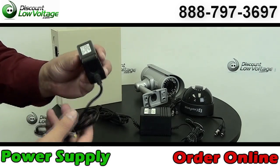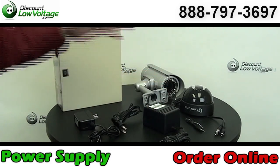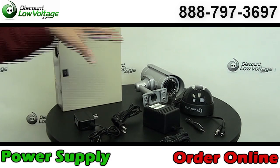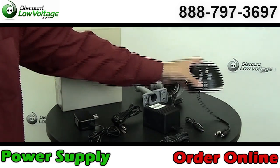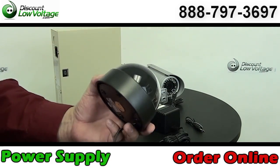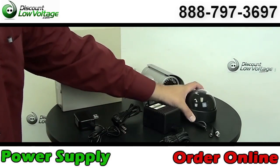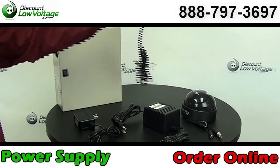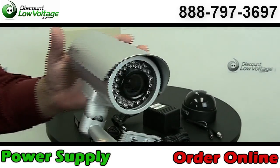Okay, so we have a few different power supplies here. We have the small 12 volt, we have the larger 24 volt, and we have the master distribution unit. We'll crack this open here in a sec. We have a couple cameras. Now you always want to make sure with whatever camera you select, you match your power supply to the camera you're using. This one here is a 12 volt, so we're going to use a 12 volt power supply. Some cameras, like this one here, are dual voltage, so it'll do 12 and 24.